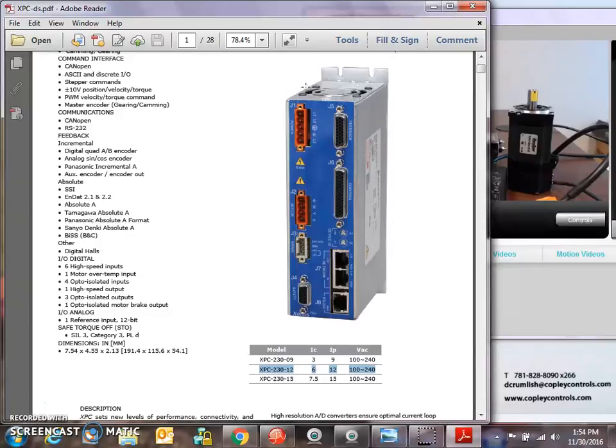There's an internal heatsink and a fan. I haven't actually delivered enough current yet to make the fan come on, but I'm sure they've tested it and it works just fine. Another interesting feature is the positive locking on all the connectors. If you have to use the Xenus as a stepping ladder to climb around on your machine, the cables won't come out.